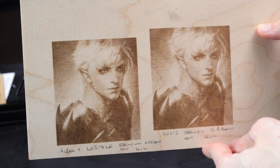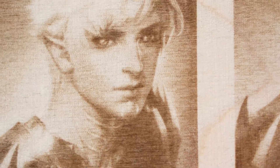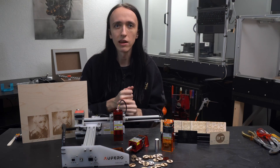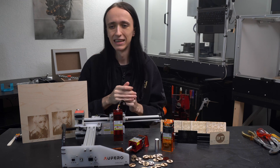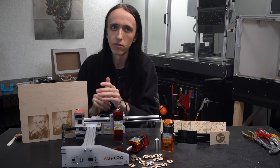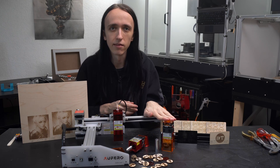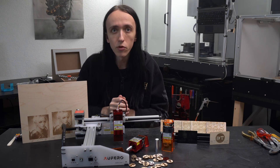With the two higher-powered lasers, the engraving speed for an image that size is about 20 to 25 minutes. But when you go back to the smaller lower-powered laser, you have to cut the speed in half — I was only engraving at around 2000 mm/min at full power. Even setting it back to 10 lines per millimeter, it took around 45 minutes to engrave the same image. So I'm really not sure it's such a great option, though the actual result you get is very clean — so if time is not really an issue, it is still a very good option.